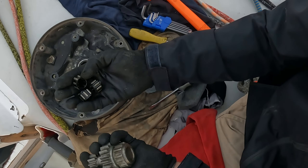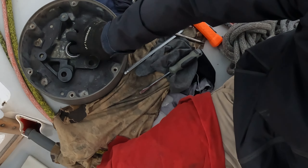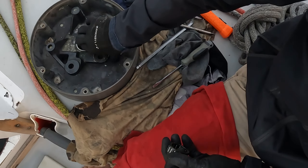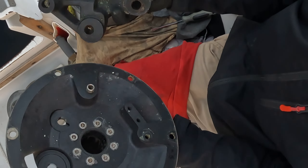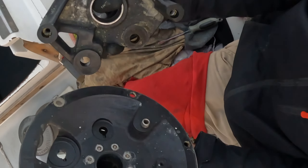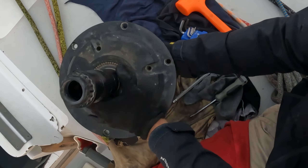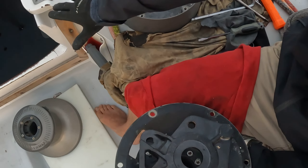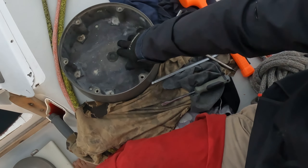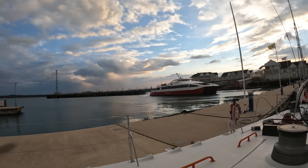The last bit: out comes the pillar — looks good. There should be three of these inside: one, two, three — all good. And then there's that bearing — finally get that out. So had we not taken that off first to show what's going on, this would have come out as a complete assembly. If I had to do this at sea I'd take it straight inside the boat. I'm going to give this a clean out, then get everything washed with diesel, water, and soap.